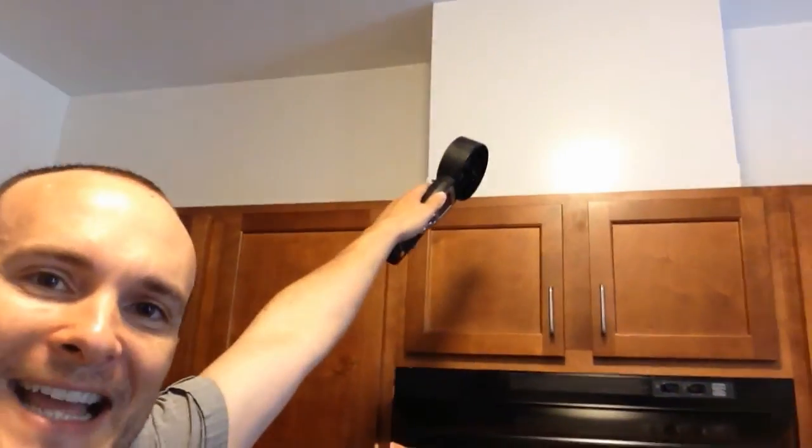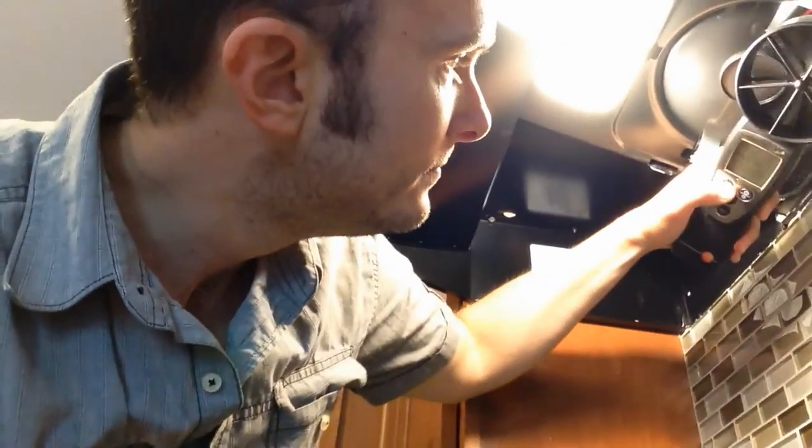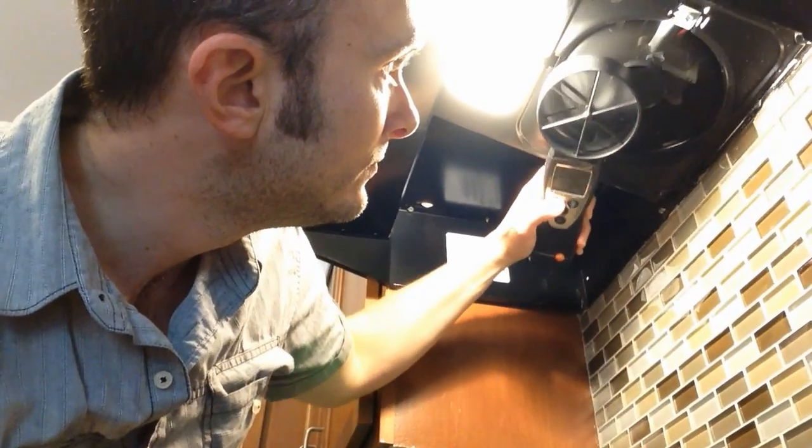In the case of this fan, what we're actually doing is testing to make sure that it actually sucks air. And since it is ducted to outside, we know that all this is good. How much the people who live here are going to be using it, we don't know — maybe never, maybe all the time. The behavior is something you can't really predict. What we're trying to do is just make sure that there's air flowing through it, period. So now that I've got it on high, I'm going to take a time-averaged reading — I can see that I've got about 126 CFM flowing through this fan.